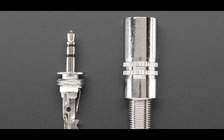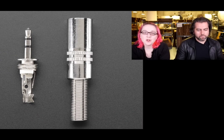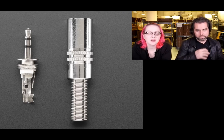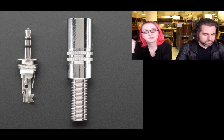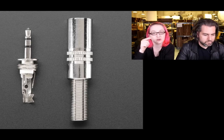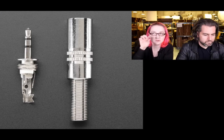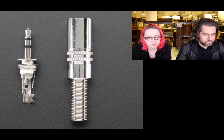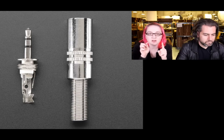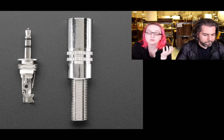They all have this similar three-piece construction. There is the connector part on the very left, and you can see there's the tip, ring, and ground connector. The ground is connected to the case ground, so this is a fully grounded connector, which is pretty good. Usually the ground is connected to the metal casing of a product. There are three tabs — a big ground tab and two smaller tabs that you can solder wires to.